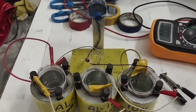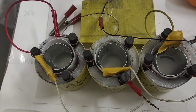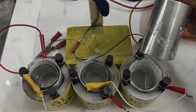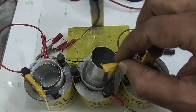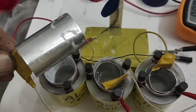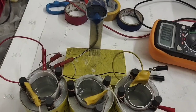To confirm: three cells connected — 1.3 into 3 equals 3.9 volts — rechargeable as well as reusable. The electrodes are half-filled with electrolyte and show no corrosion on the aluminium at all. This is the beauty of the aluminium ion battery model: no corrosion, rechargeable, reusable, long shelf life, and very economical — unlike aluminium-air batteries where alkali burns the aluminium.